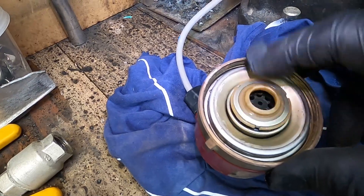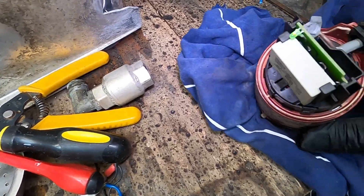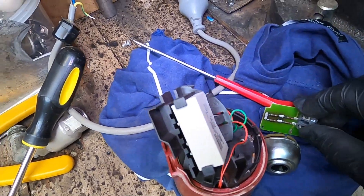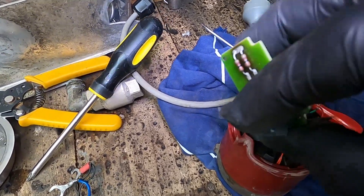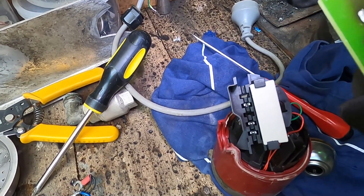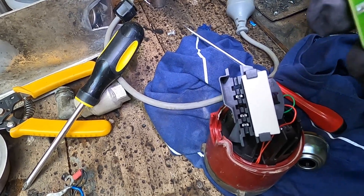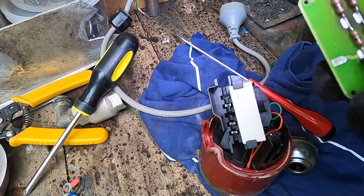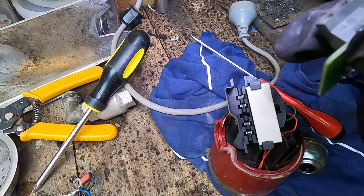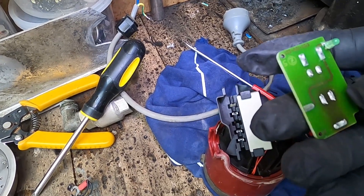It's not spinning and acting as a pump - it's a centrifugal pump - so a bit more to find out. We do have the green light on and it's got power to the board. Going a bit deeper: this PCB pulls out, you can slide it upwards - it's got the LED on it and it has two terminals. We've got the neutral going through four resistors and back up to the LED, and the live on the LED.